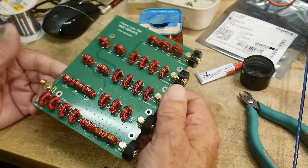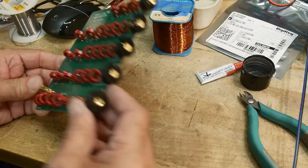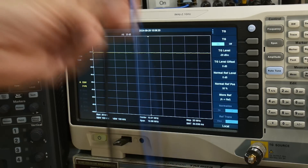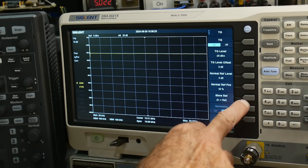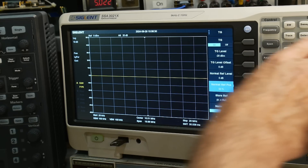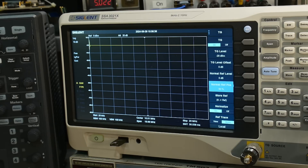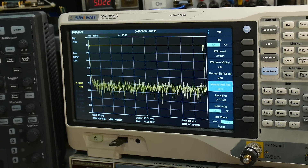The reason I bought this board is I thought it'd be a really fun thing to measure — input and a whole bunch of outputs. I put little wheels on here so we can do it easily. We will begin by making a through measurement with the tracking generator on. We will normalize it and set the reference position up to 90 percent — that is zero up there.